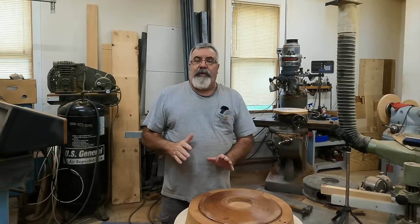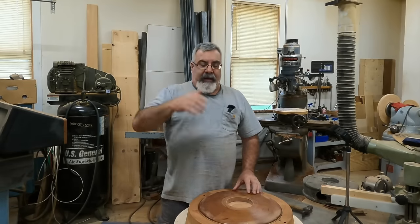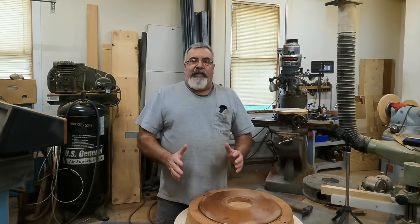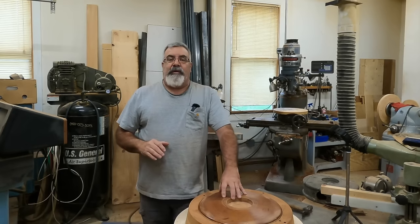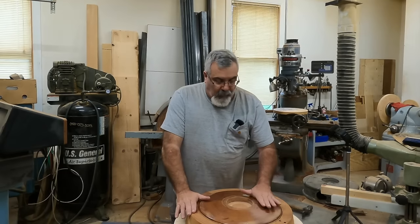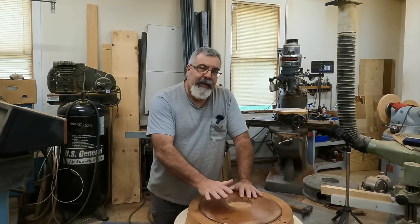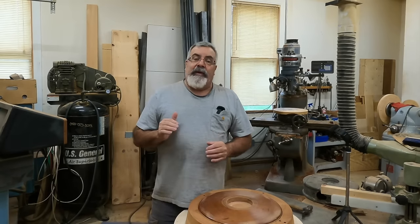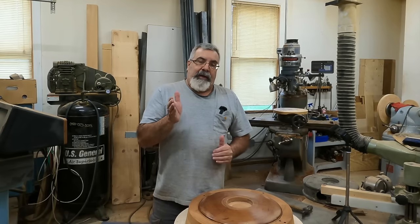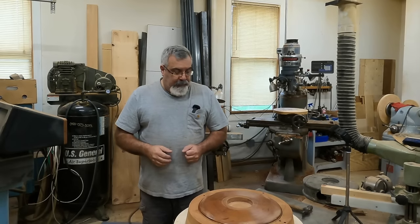I really don't need to cut this thing in three pieces, which is a good thing. All I need to do is cut that one quarter out, because this fits over the top of it. I had it in my head that I had to slide it in sideways, not over the top. So that's going to make this core print a little stronger. Technically, if we were going to make hundreds of these, I would have integrated the core print right into the pattern to make it stronger. But since we're only doing one, I think pouring part of this was the easier way to go.